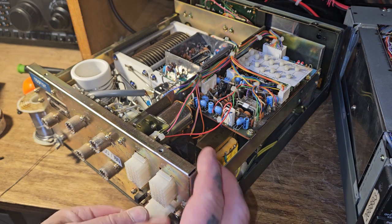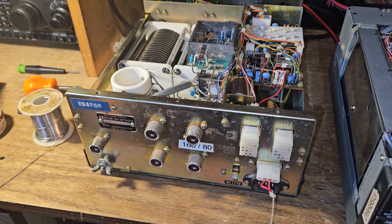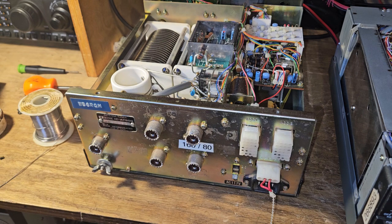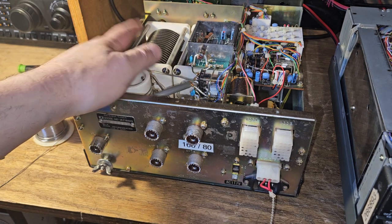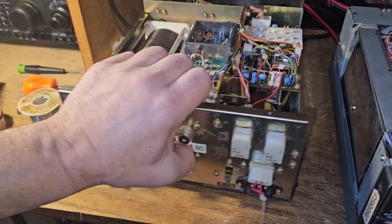There have been so many stickers on the back of here with different configurations, and I didn't really ask how he had it set up. I can see that one of the bands needs to get moved. He's using antenna number two, which isn't the most intuitive thing, but I think it's also because of the length of the jumpers inside. I really do like the construction of this — it's really nice. I had no idea these things looked like this inside. They could be used with any radio, but if you have an older-style ICOM it will follow the radio automatically.